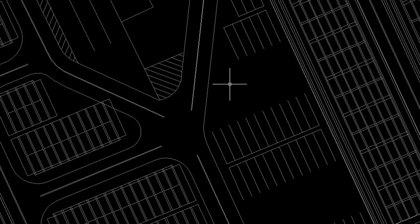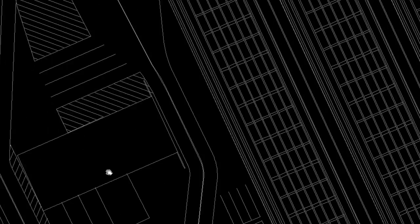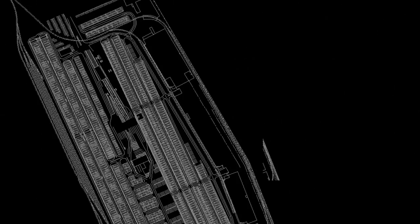You might have a machine that you're going to detail in FlexSim with a nice 3D model, but in the AutoCAD file, it's already intricately drawn. Well, all of those lines are just going to weigh down your graphics card when it tries to draw them in FlexSim. So it pays to come in and clean up a model and delete that kind of stuff at the beginning. This model is relatively clean. We don't have any excessive hatching or any machinery or anything like that, so we're going to leave it alone.